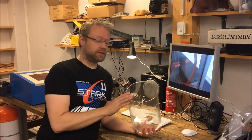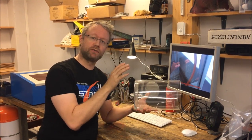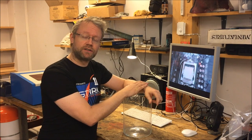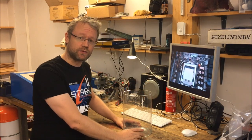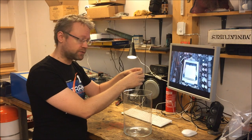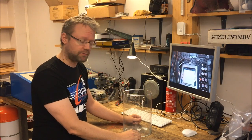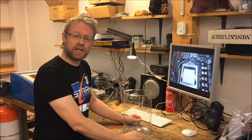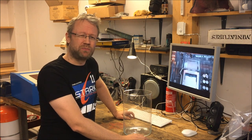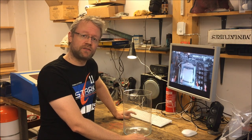Okay, so the first thing I do need to do is to create such a seal. I have this open top, I need to seal it, I need to make sure that no Novec gas can escape from it. But at the same time, I need to choose a material that I am comfortable to work with and that is easy to work with. Because on top here, I also need to create holes for getting the water cooling system in, and also for all the cabling that's not supposed to stay in here, like power and stuff, to power everything. So I'm thinking about choosing MDF. It's still a wood, but it's a compact wood. So hopefully the issue with leaking gas will not be major. Only time will tell, I guess.